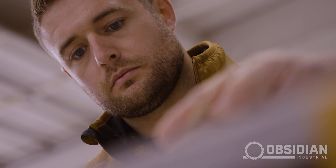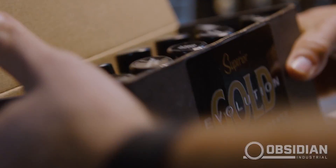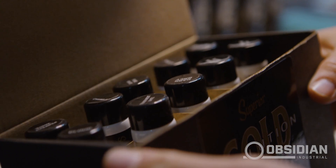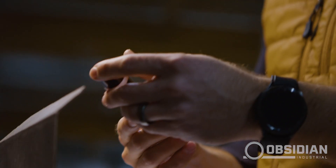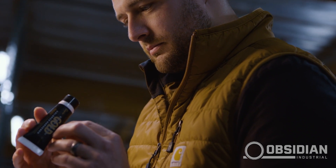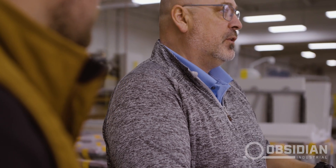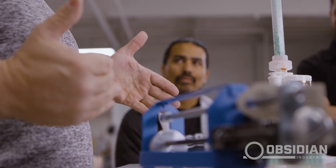Don't get me wrong — you still have to fill in chips, or you might have to do a top coat and a seam and you have to have that exact color match, and we didn't want to take that away from people. You can absolutely still do that today. But what we did with this new Gold Evolution is we made it easier to use, a lot simpler to activate. And we actually came out with 20 different colors of colored activator or colored hardener. What that allows them to do is achieve an exact match by just putting the colored hardener right into the glue, and they instantly have that color they need for their seam or their miter. We've taken a complete step out and did it all for the exact same cost and simplified the shop process.